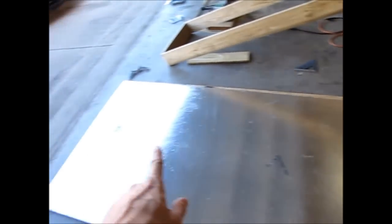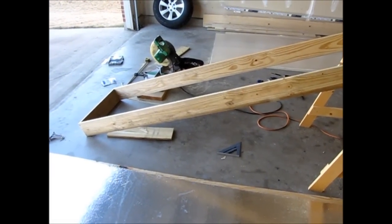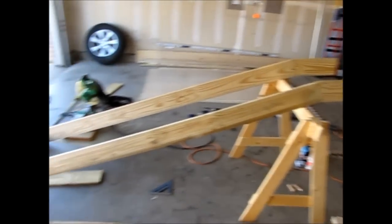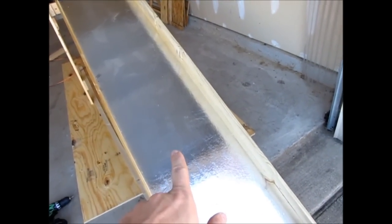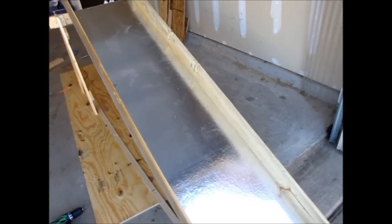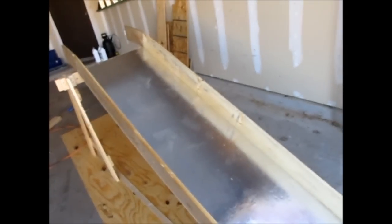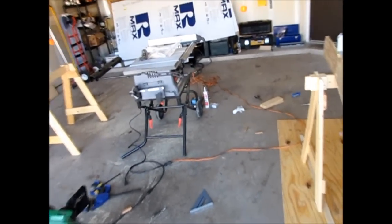Next I'm going to build a 24-inch wide by 8-foot long piece of solar board for the bottom, and get that installed to give the structure some rigidity so it's easier to work with. Now we have the bottom of the box attached with the aluminum side facing up, because we want to keep the warmth inside the box. Then we're going to take the caulking gun and RTV and caulk the inside to keep it airtight.